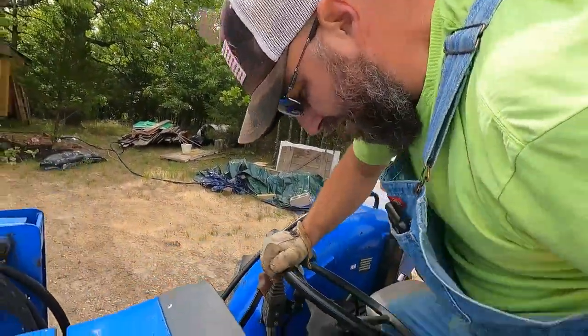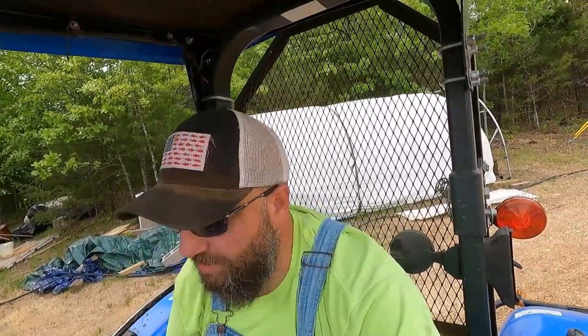That part's done. So now let's go see. Should have enough off that pallet. If you haven't used these style forks either, without being all scientific on you, it's putting my pivot point, my waypoint, out further. The bucket's rated for 3,500, the forks are rated 2,500, but the further you go away from the pivot point of the bucket, you kind of lose that. And that's where, like I said, the rear end of the tractor was flipping up. If I had to move a little bit, that wasn't as bad. I'm glad I didn't have to unload the whole thing, but let's get the next one.